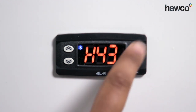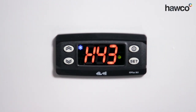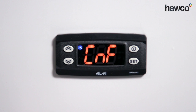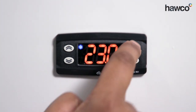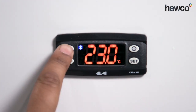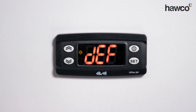So now I'm done setting it all up. I can either leave it and it will come out of the folder automatically, or press the on/off button to come back one step. If you leave it for a few seconds it will return to the normal screen, or press the on/off button again. We're now cooling because we set the set point to 20 degrees and the room is at 23 degrees — exactly what I want to see. To demonstrate the manual defrost: press and hold the up button, and it will go into defrost. As per our settings, it shows DEF. The manual defrost will run for about 30 minutes as configured, and then it will come back out and you're ready to go.